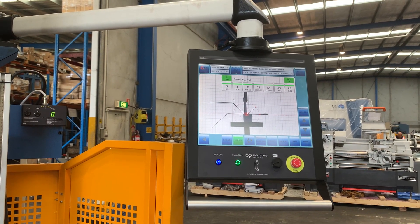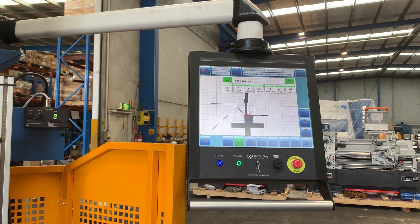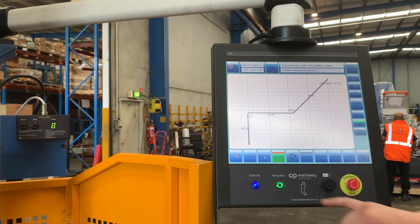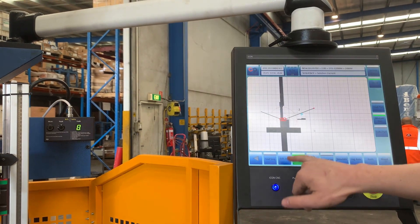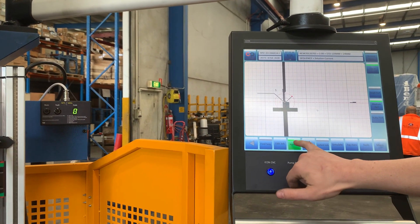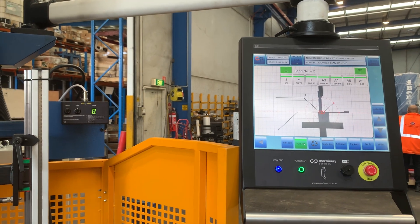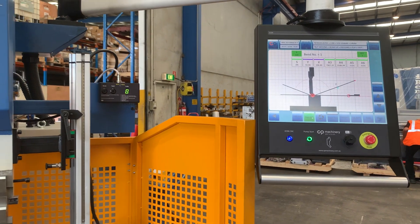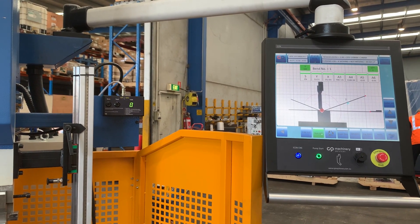It'll find the optimal sequence with the tooling that you've got fitted, so there's very little setup. You just have to set it up to match the material that you're folding. We can have a look at the job — there's the job that we're folding — with all the dimensions set up. We find the sequence very straightforwardly. Simply go to run, start it up, and it's going to position for the bend. You can see the real-time quality positioning of the back gauge, making it very easy to determine where you need to be with your material for that particular bend.